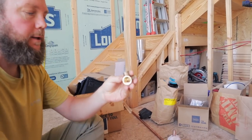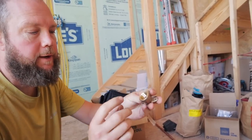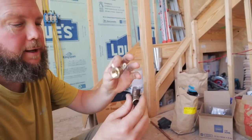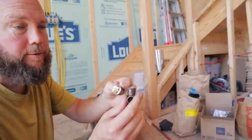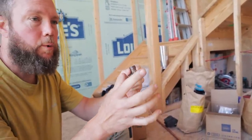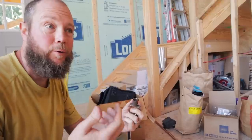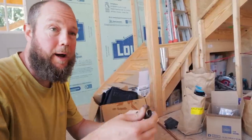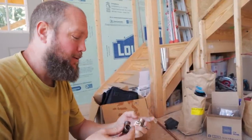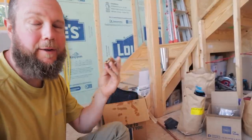This is the piece we got — it connects to our half-inch copper line and then has a threaded half-inch on the front. We needed this because our old piece had solder on both ends and when we had our tub stub out, we weren't able to get our side panel on, and I didn't see any access to solder it from behind — at least at my skill level. So I had to unsolder that piece, and we're going to get this soldered back on and then we should be good to go.